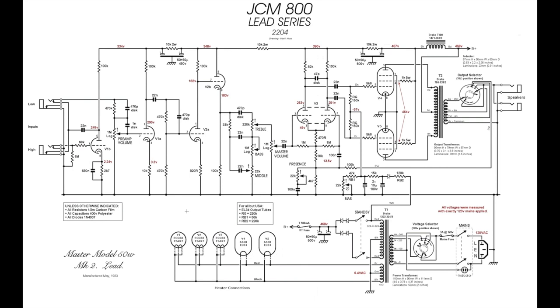So we've got obviously channel switching in the amp now. I've got the Jose clipping option disabled when you go to the clean channel, so you can have 20 volt Zener clipping active on the mini switch on the front of the amp for the gain channel. When you flip to the clean channel, that gets disabled. Obviously, I've got the FET boost on a relay as well, so all that's implemented with relays. We'll have a quick look at that from a schematic perspective.